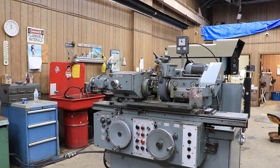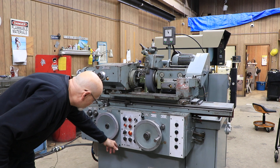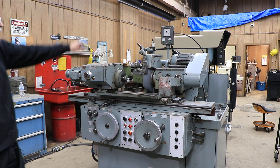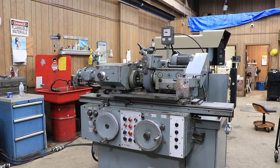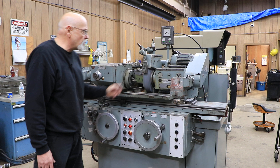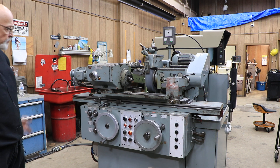It's really a pretty cool machine — I know I went on, but they are complicated and I know them pretty well. I'm sure you'll be able to use this video in the future for some assistance. You can turn one switch on here to make it so that when you hit the button, the table comes on with one button — that's when you're all set up and ready to go. But again, that infeed has to work its way down to zero each time you start a cycle or send the head back. Once it's fed all the way forward, you can touch your part and start your feed. Each time you send that head back, that piston on the side of the machine is going to be going back and forth with it.